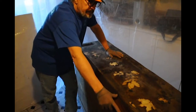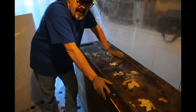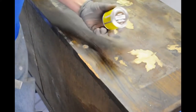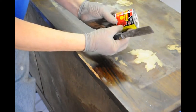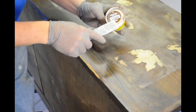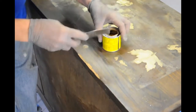Right over here there's an area where a mouse has chewed the wood. So we're going to fill that in with some plastic wood, let that set, and then we'll sand down the top to get it ready for finishing. I purchased from my local hardware store a plastic wood professional wood filler, and this one happens to be the color of walnut.